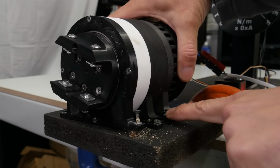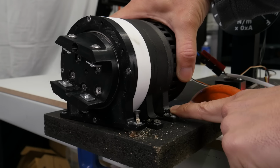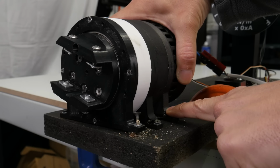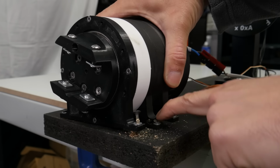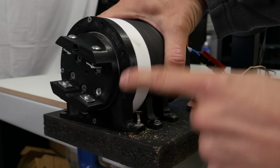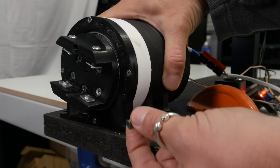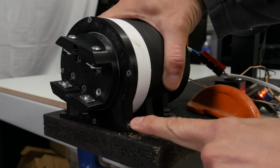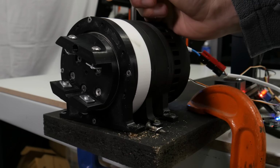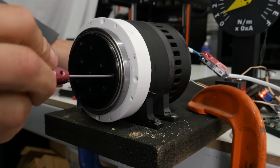This rear mount is cracked, the middle mount is cracked, the front one's intact. Now this was in nylon, but fairly thin layers. I never replaced this one. I think there's only 2 perimeters. This was PLA-CF, I think a few more perimeters, but again, I don't think I replaced that. This is polycarbonate. This is Polymaker's PC Max, and it's actually ripped the screw out of the board, and that's still intact. I can't back drive the gearbox, so there's clearly some damage inside, so I'm going to have to take it apart to look at that. And none of these are bent, so that upgrade worked.